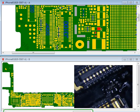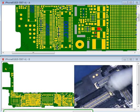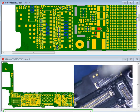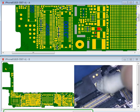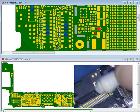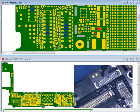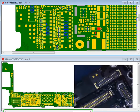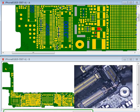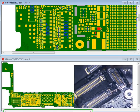I think what I'm going to do is put some solder mask on it, then put a component in there and let the solder mask hold it in place, and then probably just jump it to the number 2 spot on the connector here, and the other part I will jump to here. Let's see if that works.